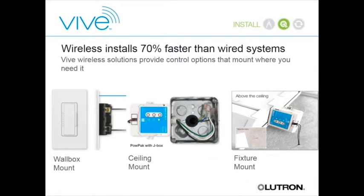One of the major advantages of the solution is that it is wireless. We wire load controllers to the high-voltage and zero-to-ten-volt inputs, but beyond that the rest of the solution is wireless, which means we can install it much faster than a traditional wired system.